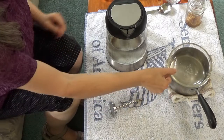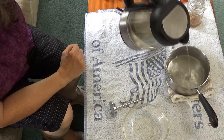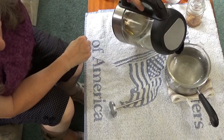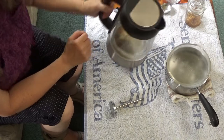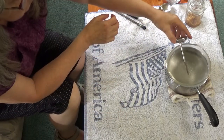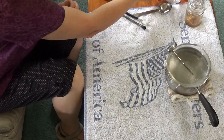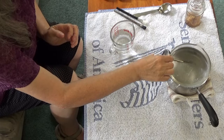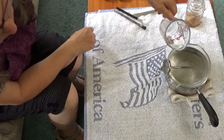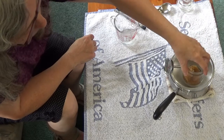The tricky part is keeping the glue at 60 degrees Celsius while you're working. I poured some very hot water into my pot and covered it with a Pyrex dish — the water on the bottom just keeps the upper water from cooling down too much. Then I poured more hot water into the dish. I should have picked a deeper glass dish for more room to add water later. This method is only useful for projects taking a few minutes; for longer ones you'll need a small electric burner. I added cold water until the outside temperature was about 65 degrees Celsius, which I had previously confirmed gives 60 degrees inside the glue container.